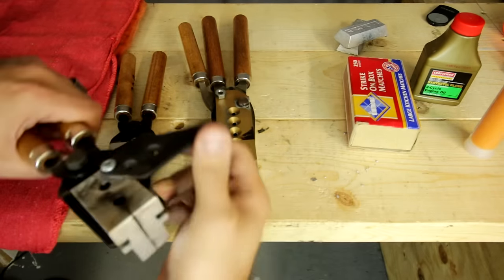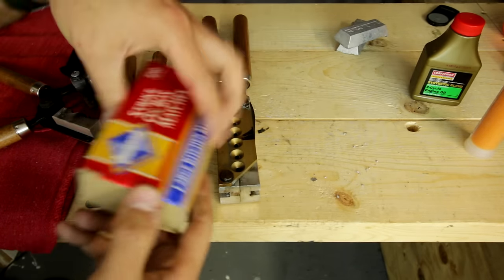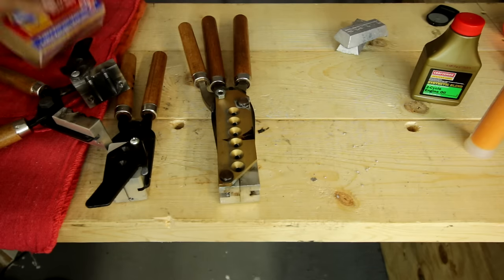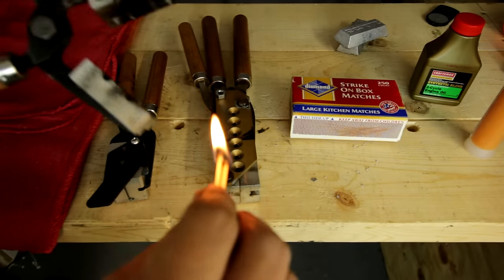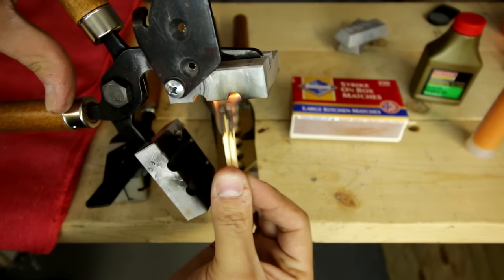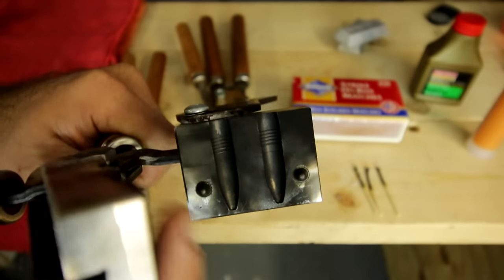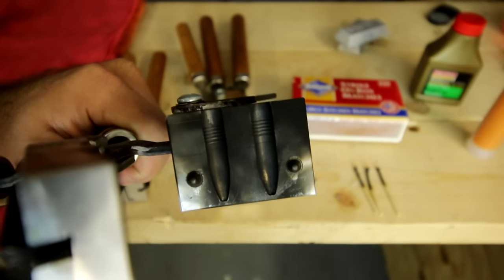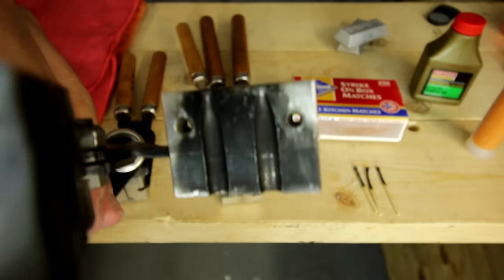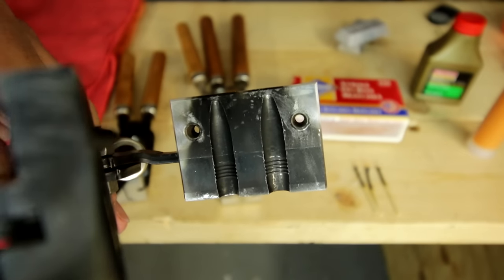To smoke a mold, all you need to do is open it up. This is already pre-smoked but I could use another smoking. Just grab a couple of matches and you're basically going to smoke them up — see all the smoke there? And there is the newly smoked side of the mold — you can see a very nice, even distribution of carbon on there, basically making the mold non-stick. Compare that with the older side that has been smoked but not recently — you can see it's starting to wear away and is not nearly as even.